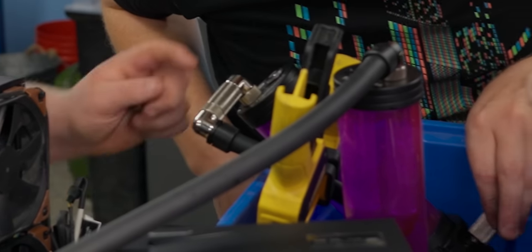We run the TECs standalone. The block is getting cold — you can really see it on the FLIR. One side is around 30°C, the other around 10°C. The tubes are getting very cold. One water block that water wouldn't flow through ends up exploding, so we take it off, couple around it, and rebleed the system. After fixing that we check the cool plate — it's frosty and reflective; the thermal camera can't even get a good read on it.